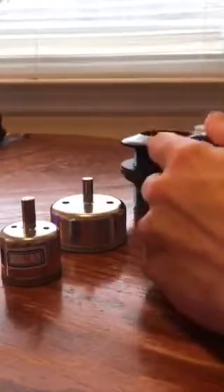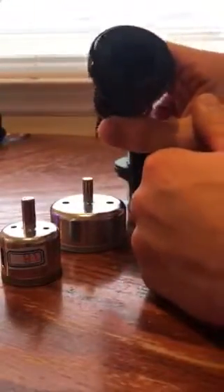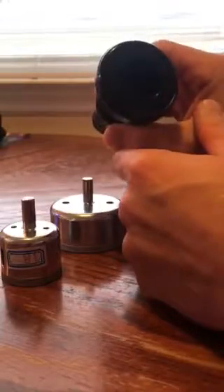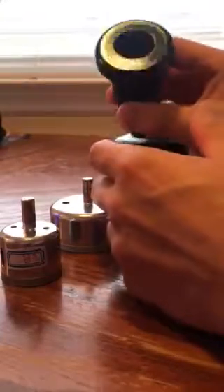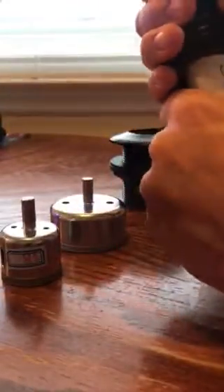Just because your bulkhead is, say, a three-quarters inch bulkhead, that does not mean it takes a three-quarters inch hole in the glass. That means it takes three-quarters inch standard PVC piping into the flange. You slide that in and it makes a watertight seal once you glue it.